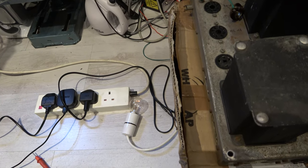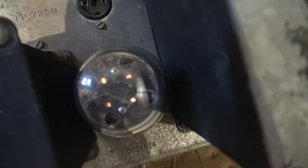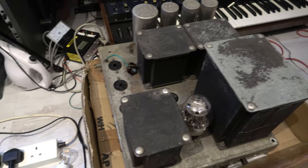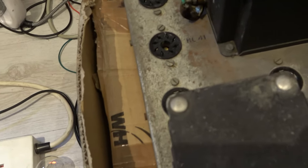Still a bit of romping as well. So if I look over there you can probably see the little glowing dots. The rectifier is actually rectifying - so that's kind of a good sign. There isn't a massive increase in brightness of the bulb. So I'm going to put the other two valves in here - the SP41 and the HL41.